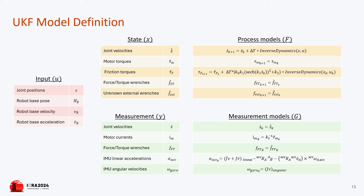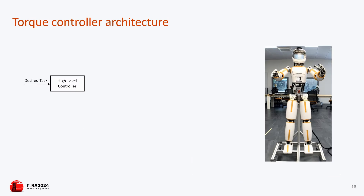To overcome these limitations and enable joint torque control on such robots, joint torque estimation becomes pivotal. This paper contributes towards the design of a joint torque estimator, based on unscented Kalman filtering and sensor fusion techniques to integrate data from distributed sensors, validated on the humanoid robot ergoCub with a two-layer torque control architecture.